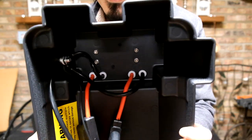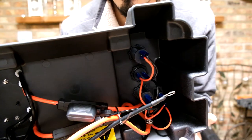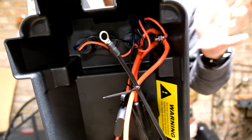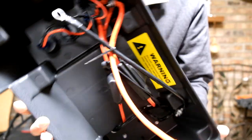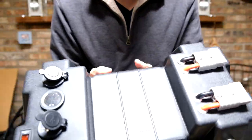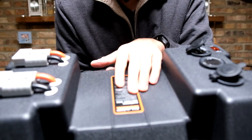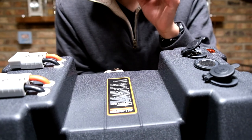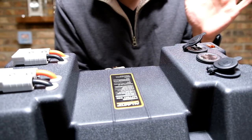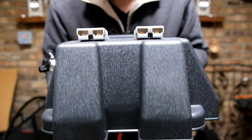The wiring inside is very clean and neat. I didn't find any loose bolts — everything was very snug and well-built, and the quality control seemed up to par. The gauge wire going to the battery is pretty stout. Specs include USB at 1 amp and 2.1 amp, a digital voltmeter, polypropylene plastic construction, a 16-amp reset switch, external terminals, a tie-down strap and carry handle, and two 50-amp heavy-duty Anderson-style plugs for solar.